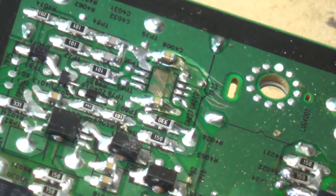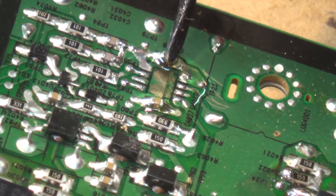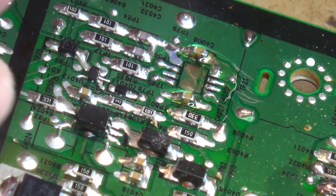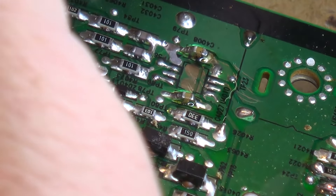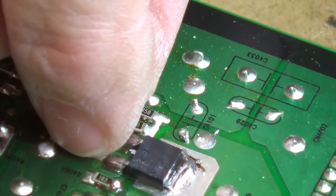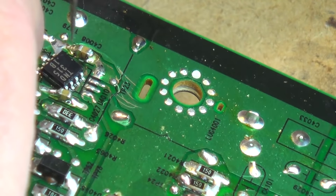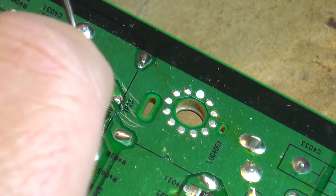The chip is tiny — look at the size of that little sucker, it's got a little protective case. Pin one is going up in this corner here. You can see the little notch right down here on the board that indicates which way the chip goes in. The chip itself has a little dot to designate pin number one, and that's the direction it goes. I'll just use my little pick to move it into place and line it up where it needs to go.